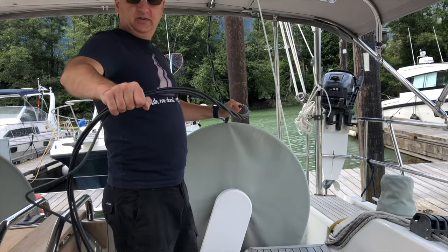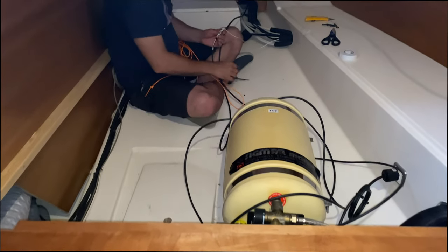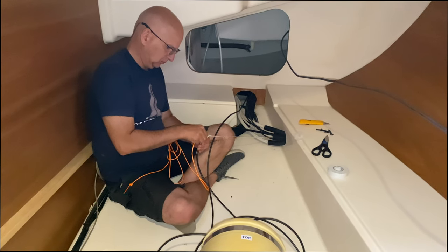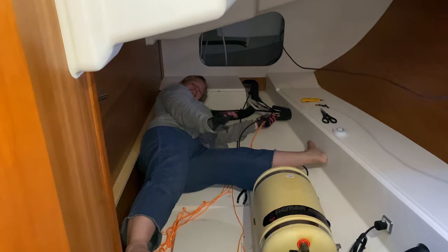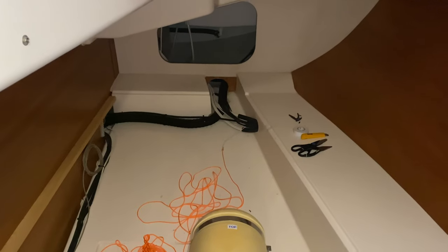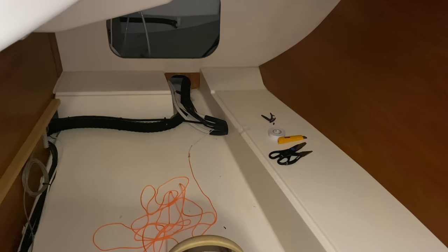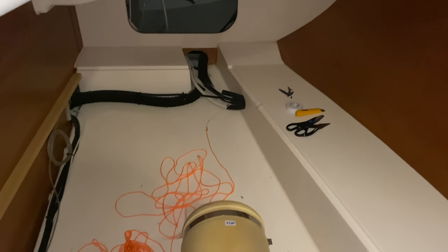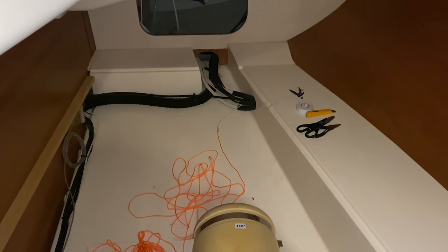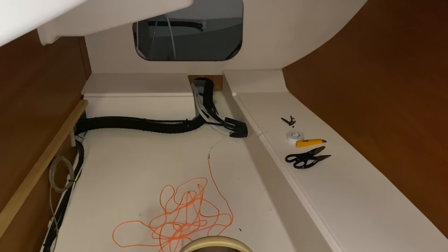I might need your help to untwist these in the opposite direction. That's the aftermath of all the cables being pulled through. On the right there are three conduits sticking out - the one in the middle had the pull-through cord. I used an orange piece of line to pull it back out again to use for something else, although there's not very much room after pulling four cables through. It was quite a grunt and took a couple of hours.